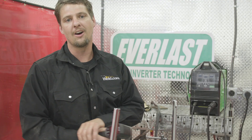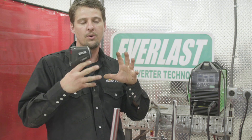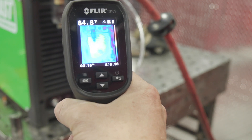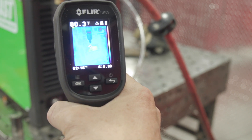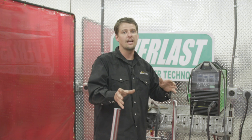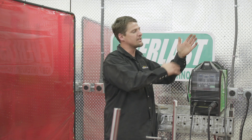Tip number six is to allow your machine to cool down. If you're cutting for an hour or two hours straight and you put your plasma stuff down and shut your machine off right away, the machine is already hot and the fan stops cooling it. All that heat inside just stays still with no air moving through it. The fan needs to be running to pull cold air from outside the unit. Walk away for 10 to 15 minutes and then come back. The best indication is to put your hand near the external exhaust where the air is blowing out of the machine. Get in the habit — if you know you've been cutting for a while, feel that air against your hand. If it's cold, go ahead and shut it down. You're fine.